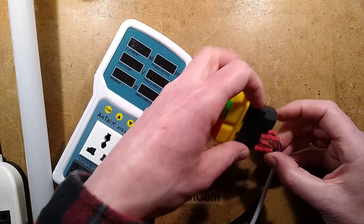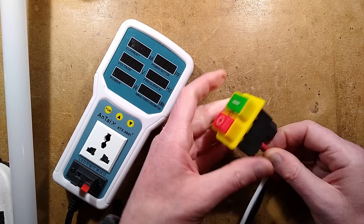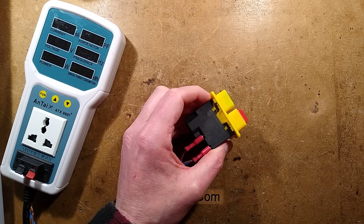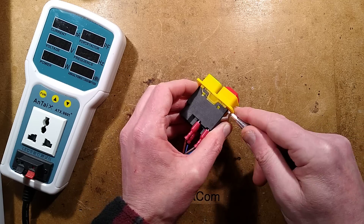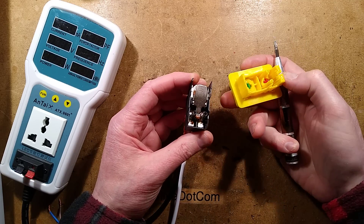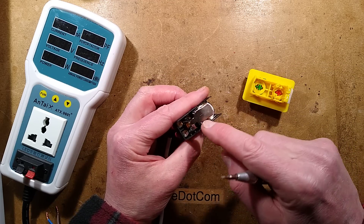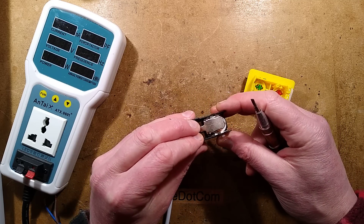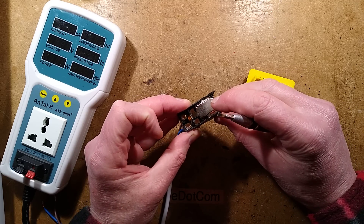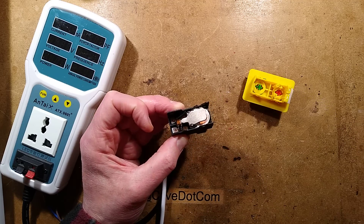I'll put this stuff out of the way. I'll try to pull these off without completely - it is actually disintegrating but that's okay. I'll just leave it with the wires on. Opening it up, you can see the two button actuators pressing down on this rocking plate here, and these springs are the ones that actually push the contacts down. When you press the start button there's a coil under here, and it pushes the keeper plate down onto the coil and also bridges the contacts. When the contacts are bridged it energizes the coil, and that's what holds it in a locked state.